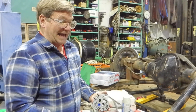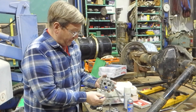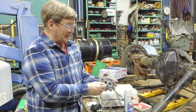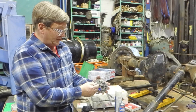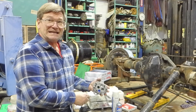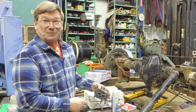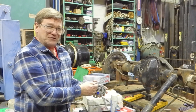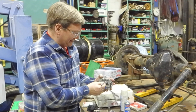A real common one that you'll also see — and a lot of people want to order these for projects, I say don't, just try and avoid it. They have, and you'll see this with motors a lot of the time, a little pilot valve that goes back and forth in here. It kicks back and forth side to side. Whichever side has high pressure, it kicks it to the other side and ports it so that the low pressure side connects to this hole and lets the oil come out. Well, if you've got any dirt at all in the system, those will plug up, and that will be another troubleshooting thing where you've seen the seal blow out because that little valve that slides back and forth gets stuck and it's a problem.